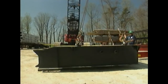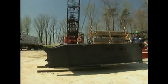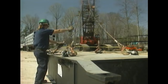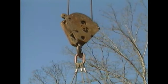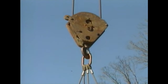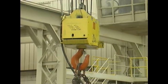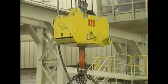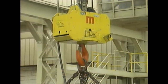When wire rope is used to lift a load, it tends to stretch and untwist; when lowered, it contracts and twists in the opposite direction. To prevent this twisting motion from transferring to the load, some type of swivel is often used. All cranes rated at 10 tons or more, as well as most smaller cranes, have a swivel built into the crane hook, but swivels are also available as separate components.